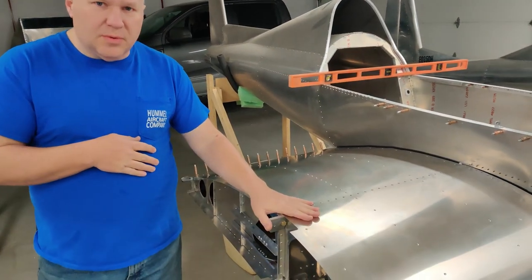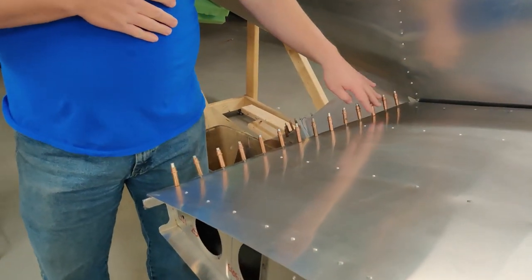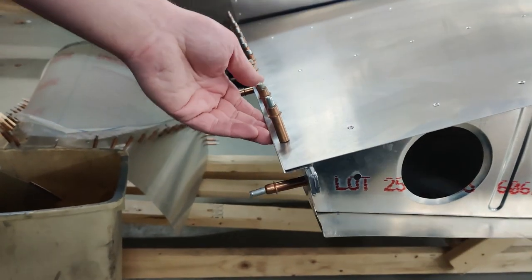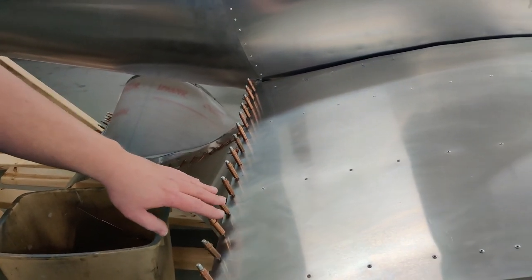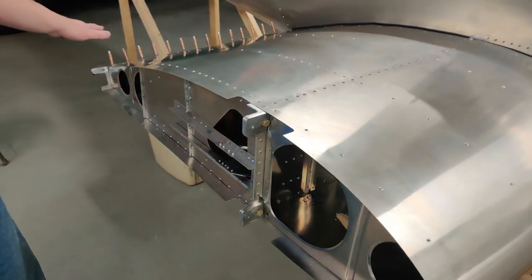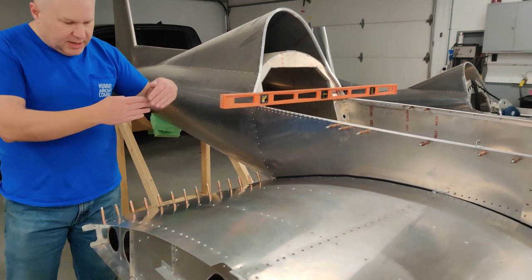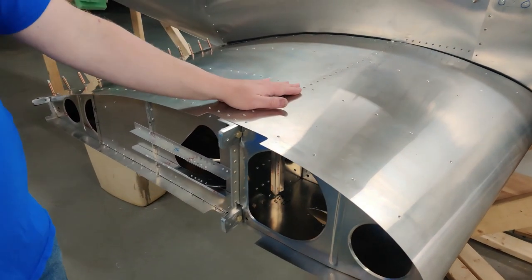When all done, this is what the center wing should look like — everything's riveted. When you get to this point, don't rivet the back line of rivets just yet, whether it's an Ultra Cruiser or an H5. On the Ultra Cruiser the trailing edge goes under the skin, and on the H5 you're going to put a flap on here, which will be covered in a later video. Leave that clecoed for now and come back to it. Everything is in place, riveted permanently — the wing was straight, no twist, perpendicular up and down, parallel to the side rails, and parallel at the pickup point. Take a straight edge across, measure, keep everything straight when you rivet, and it will stay straight. That's the center wing on both sides.